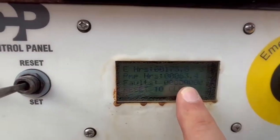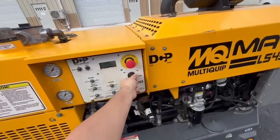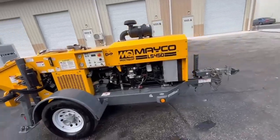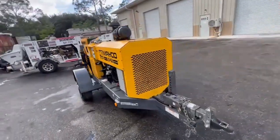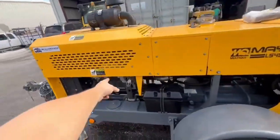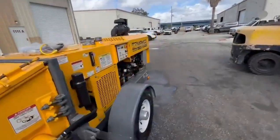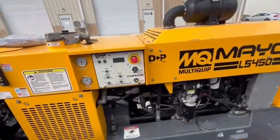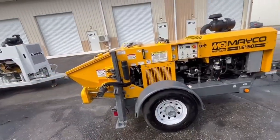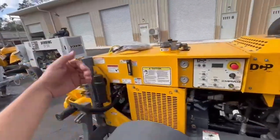63.4 pumping hours and 173 engine hours. Look at that. It runs and sounds like a brand new one — that's the muffler. No weird noises, no vibrations, no weird fumes. I can't run it right now because we don't have water in the hopper, but they already checked that the seal the piston cups are making is pretty good, and also on the wear parts.